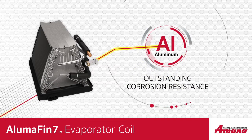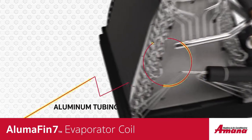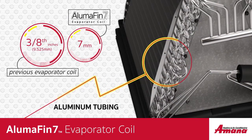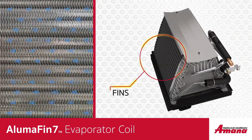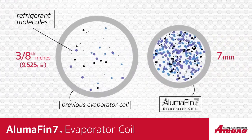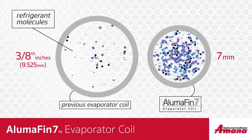Aluminum has outstanding corrosion resistance that can help extend the life of the evaporator coil. The Alumafin7 evaporator coil tubing is just 7 millimeters in size. These small tubes carry the cold refrigerant across the fins, which is where the condensation or water vapor removal process occurs. The tube size is important because the smaller the tubing, the more efficient the heat transfer process.